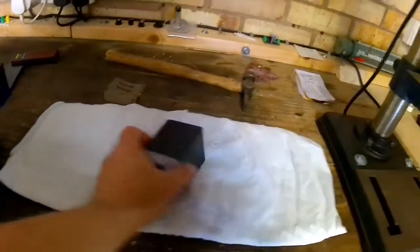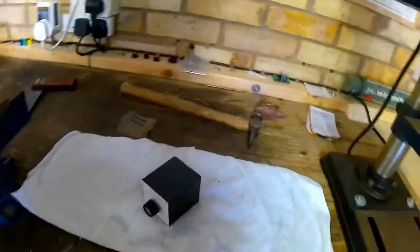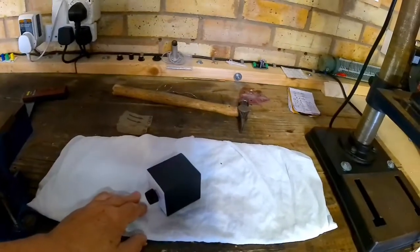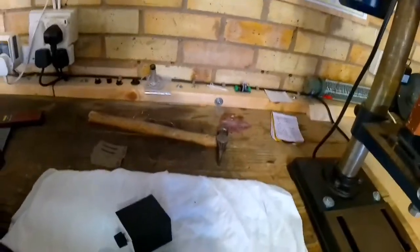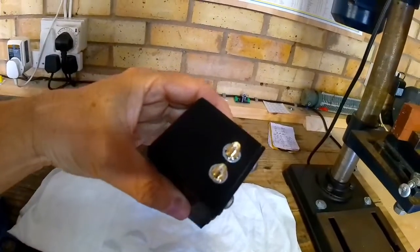Anyway, I've checked the DC resistance against the original design, which I got from the internet. It's not my design, with the resistor values, and DC wise it steps through okay from 1 dB to 30 dB with the right DC resistance values. It's 50 ohm impedance in and out.